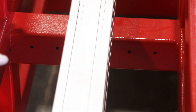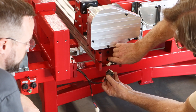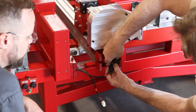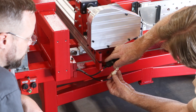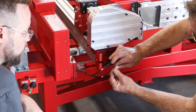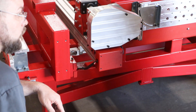Each one of these horizontal tubes is pre-drilled for the turning center — the holes are already there. Now for the plug part: this is the data cable, and it goes together just like that. These neat little screws have to be tightened, and it's keyed so it only goes one way. It snaps and locks in place so it can't come apart. Then you put the cable safely away and put in the four screws to put the cover back on.